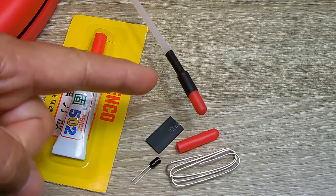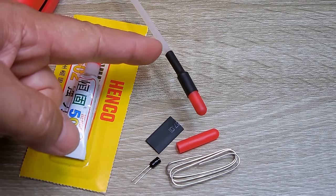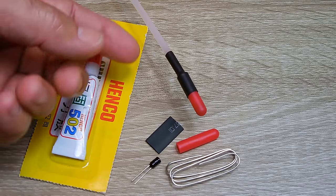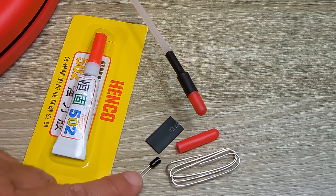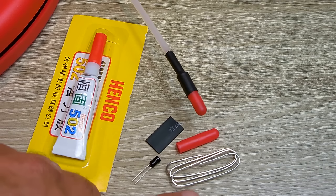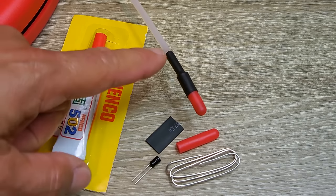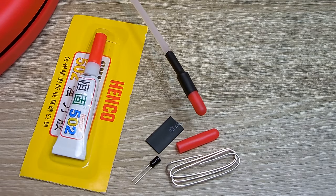In the event that this cable got stuck inside a conduit, broke off, or was damaged, you can cut the cable and expose the two wires inside. You would strip it lengthwise using a razor blade, trim around the outside edge, and pull off the sheathing to get to those two wires. You would then trim them short enough to solder a new radial inductor onto the end of the cable using the provided solder. Then place crazy glue inside the red cap, slide it over the radial inductor and cable, wipe off any excess glue, allow it to set up, add a little piece of heat shrink on top, and you're good to go.